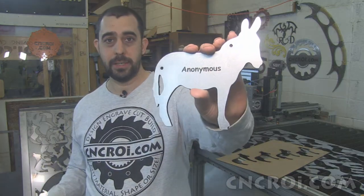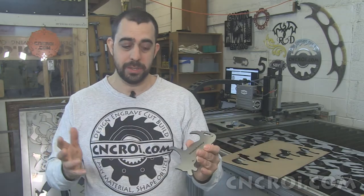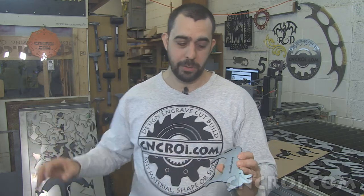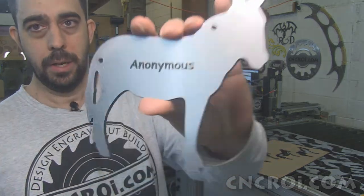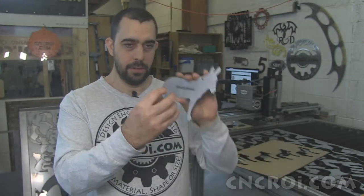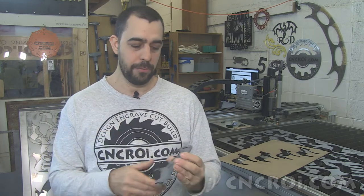And you guessed it, after fiber lasering, I gotta wash all these guys all over again. And that, for the plasma cutter, I'm removing the dross a little bit with the angle grinder and that kind of stuff in the sander. But with the fiber laser, what I'm doing is etching into the steel and I'm changing the chemical composition of it, but it's still all steel. So when I do that, you get like a fuzz of stainless steel around it. It's the same thing as when you're engraving stamps, you get the stamp fuzz all around the stamp, and it just comes right off with water. But again, it's something you gotta do.